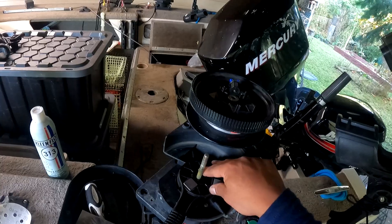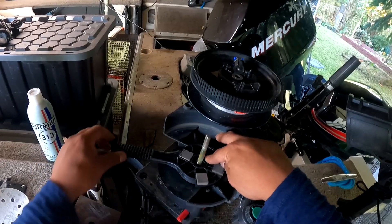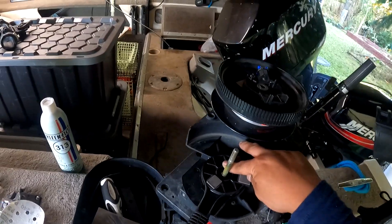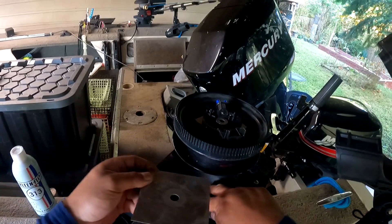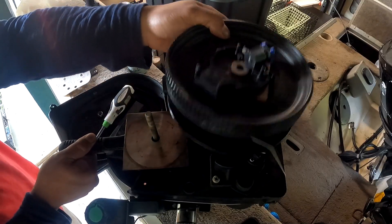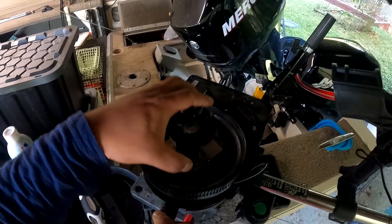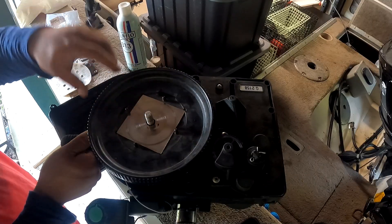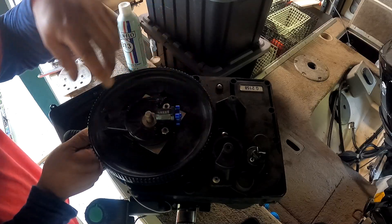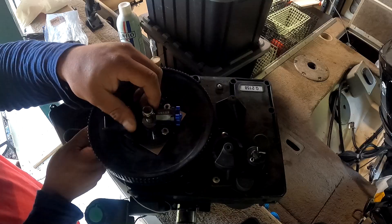Center your brake handle. If you put a little bit of pressure here, you'll know you're doing it right — when you pull it back, the brake wants to return to the brake setting. So when you pull it back you're releasing the brake; putting it forward is when the brake is applied. Up next is our brake plate. Put your handle on the handle just like that, then put our spool on top. Put the plate back in, then put your counter in. Don't forget that washer right there, and put your nylock back in. This procedure is going to take about five to ten minutes depending on how efficient you are.